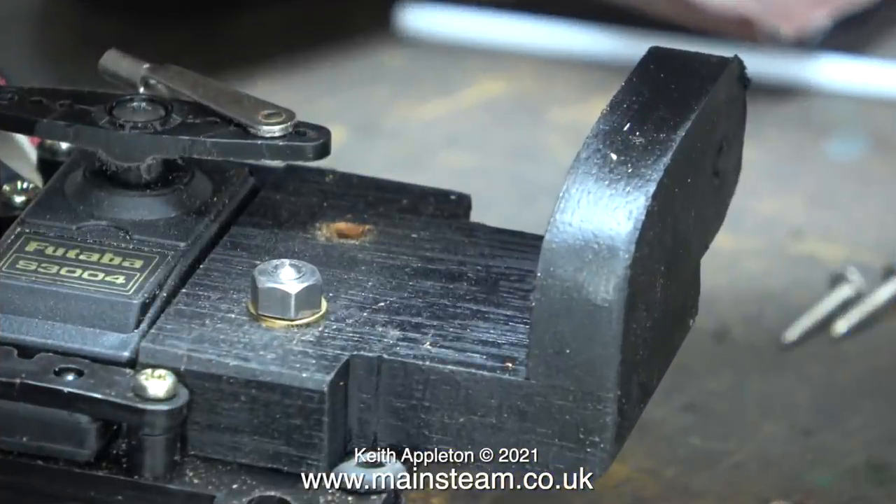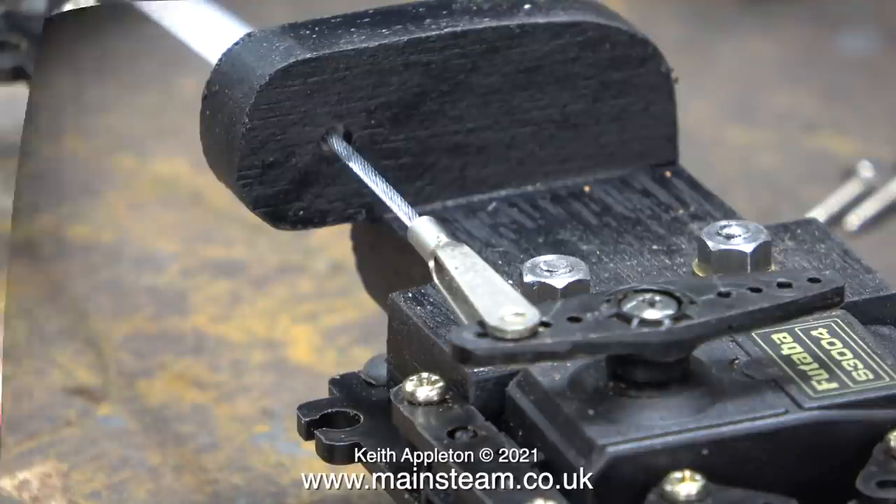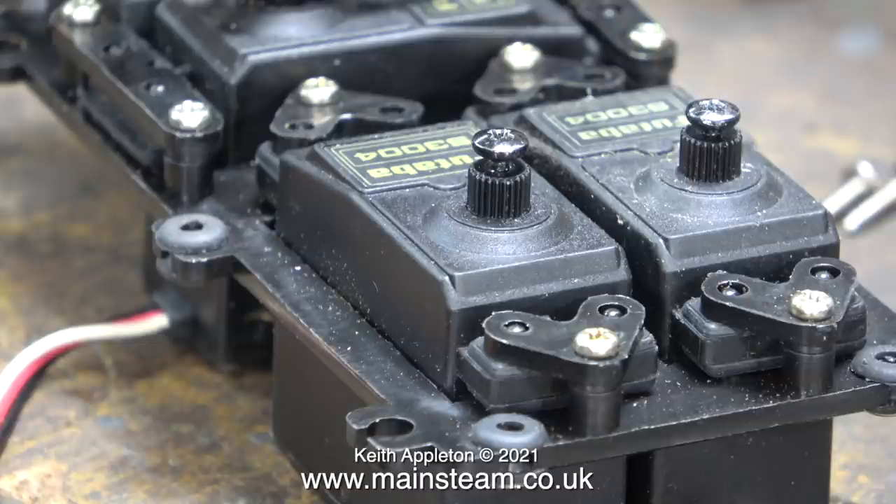While I've been working on the engine, the paint has dried on the part I made for the bowden cable support. Here you can see the wooden support bolted into position on the servo tray using two 4BA nuts and bolts. I've loosely placed the inner wire into the clevis, and very shortly — in the next episode — I'll be soldering that in position, fitting the completed servo tray, and soldering another clevis on the other end of the bowden cable which operates the throttle lever on the carburettor.